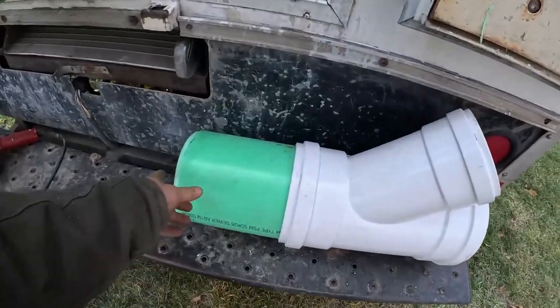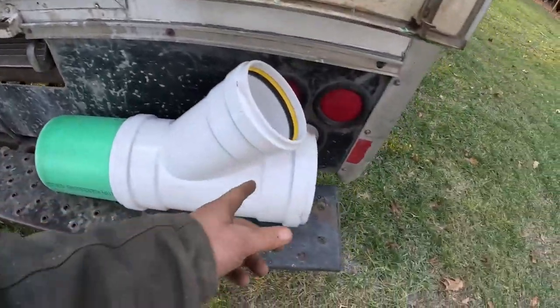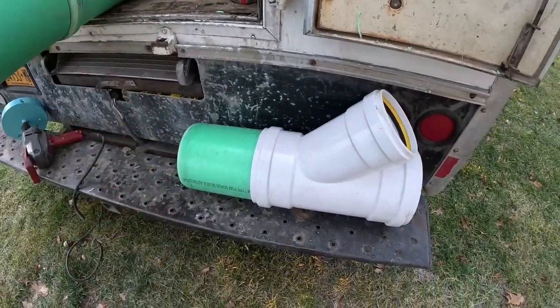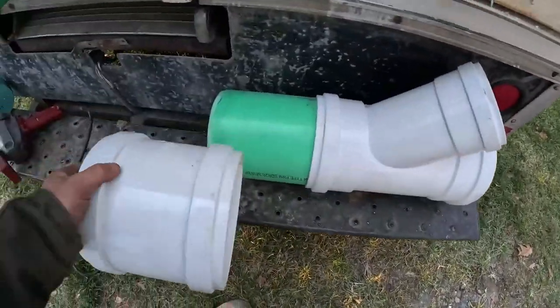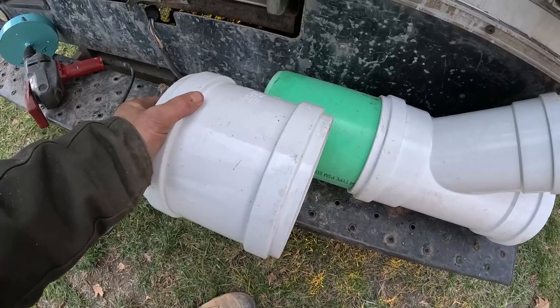So what I'm doing is making my pieces. I made them 13 inches. So this is into here. Make the other one. It'll be sticking out over here. Then that will measure from here to there, will be my cut on the main down below. Then this new piece goes in with these repair fittings. So I made it so this will be right tight like that. When I break the sewer open, boop, just set that in there like that.